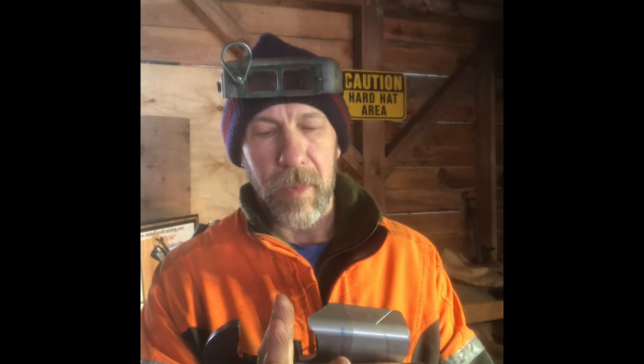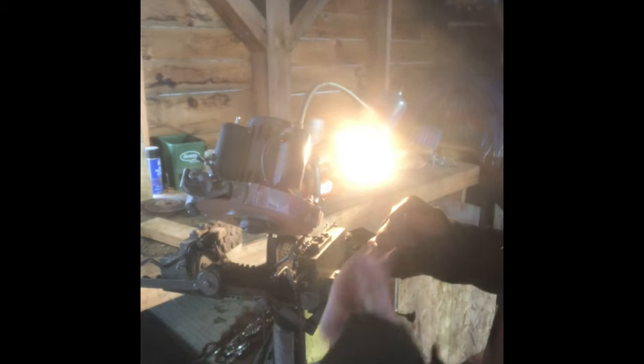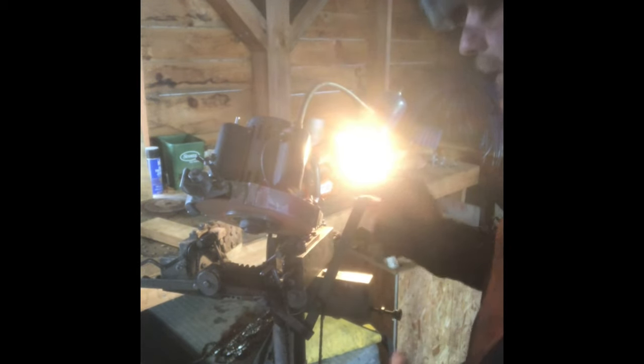I find that little subtlety — five degrees forward — and then there's a few other modifications I do. I was thinking I'll make another video on modifying the chain to get a little more speed out of it. But for now: five degrees forward and that ever-so-slight under that corner. I'm throwing in a quick clip here showing you this up to speed. I have a chain that's lost its edge — about twenty percent of that cutting speed — and I'm going to be touching them up.